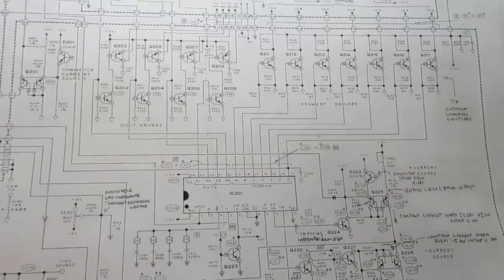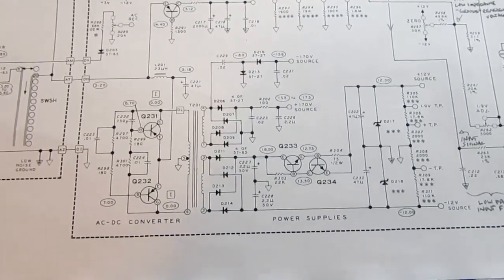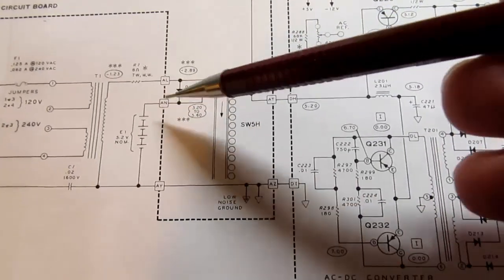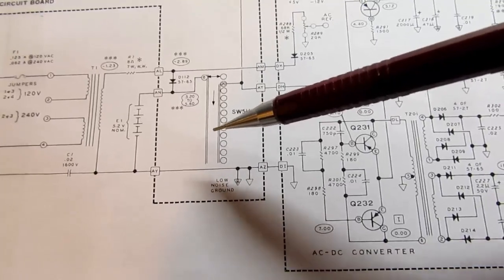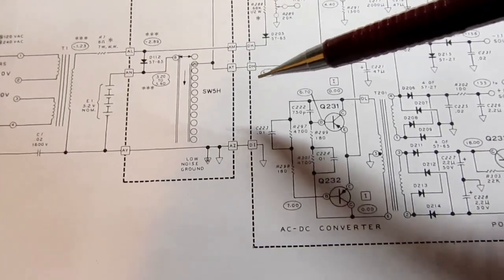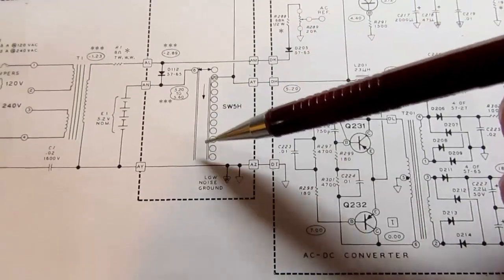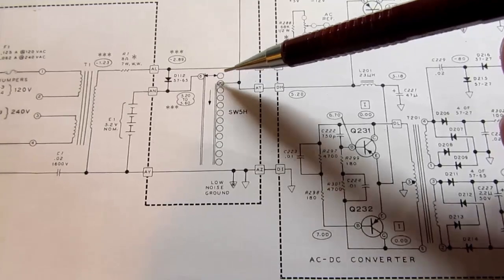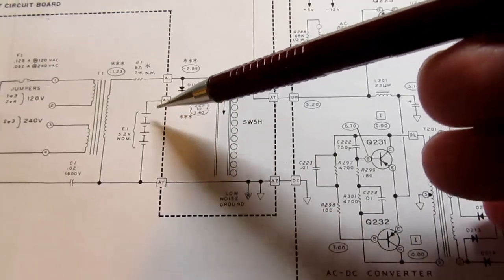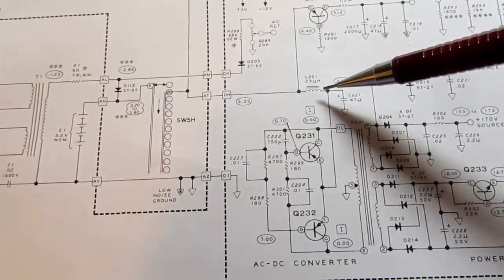So the only thing I have left to talk about is the power supply. Okay, I'm doing the power supply last here. I've already covered how the basic battery charger works, and that essentially because the meter is powered off of this position, and this position goes through yet another gang of switch 5, which is the range switch. It's also the power switch. Whenever we're in any position besides off, the top or plus side of the battery is connected through this switch and into the power supply circuits here.